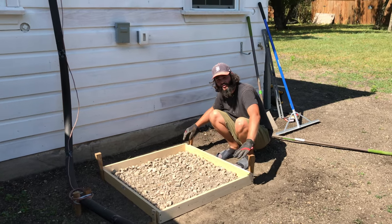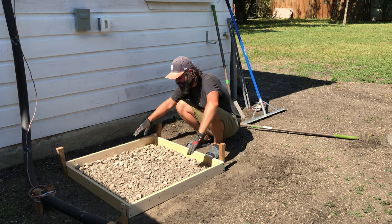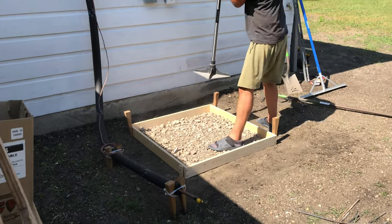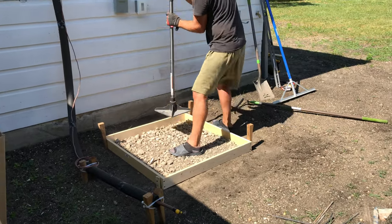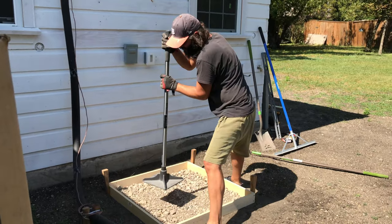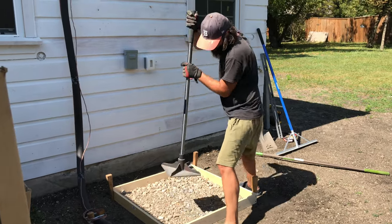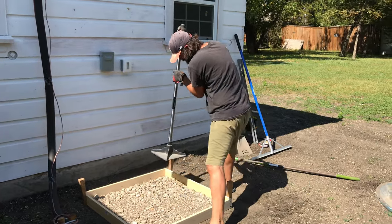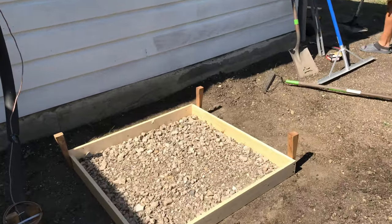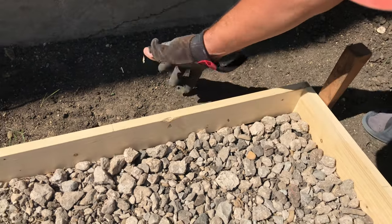Normally I would want to go a little bit below the ground before I did something like this, but in this case I'm going to raise this ground up later. You've got to put some elbow grease into that compactor. You're going to be a strong man. That's pretty flat. Now I'm going to start mixing cement up. I may have made it a little bit too soupy, but it will soak right into those rocks and everything. So let's go for it.